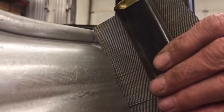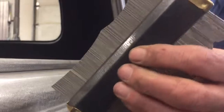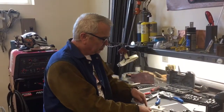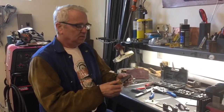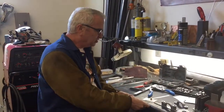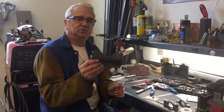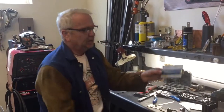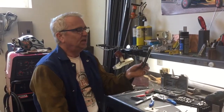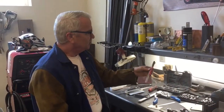This tool here is made by General — it's a contour gauge. If you want to find out the contour on something, just push it up against it and it gives you the contour. Then you can transfer it to your piece of material, like a frame corner for a motor mount tab. It mimics the shape so you can come over to your metal, trace it off, and know it's going to fit because you've got the exact shape. When you're done, just straighten it out. I don't think it's more than ten bucks.